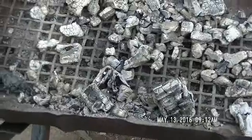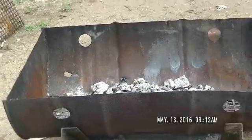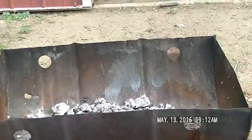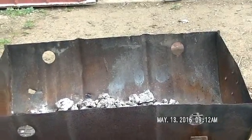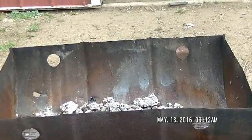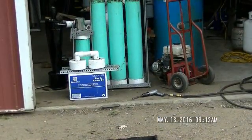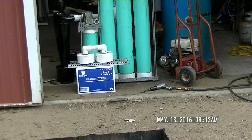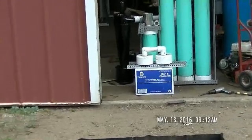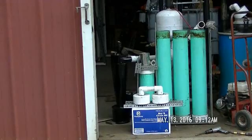I'm going to put the wood chips on top of that plate and dry them out — I just want to dry them out, not burn them. The bad news was I couldn't seem to get enough wood gas out of the filters the other day to run that Honda engine sitting right there. I figured maybe the filters are plugged up, and I was thinking the fiber fill has got to be the culprit if there's moisture in there — that stuff is just going to wad up.